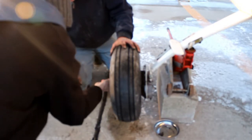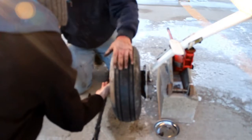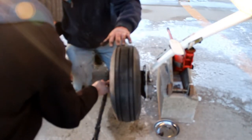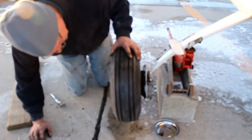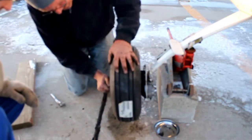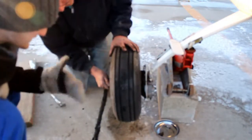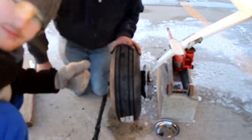Now don't go tight. Just start feeling it. I'm gonna start moving this. You're too tight. Loosen. Loosen. Stay right there. Cool. Right there. That's where we need it. Just gotta have a little bit of wiggle. Let me just do that again to show them. See, that's too tight because it should spin. Should spin perfectly freely because the bearings are inside the tire. There we go. And we're right just there, kind of squeezing the bearings relatively in.